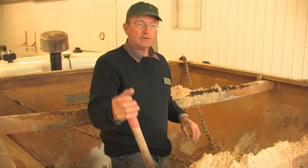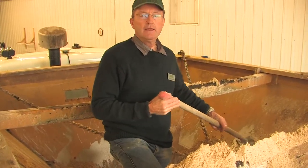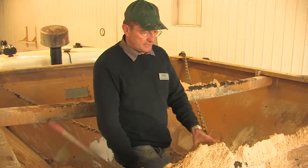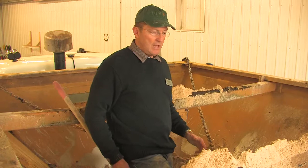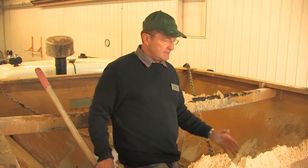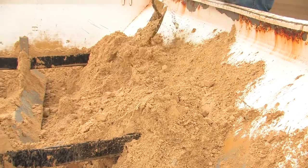Here we have a different setup — this is stainless steel but it's painted, and unfortunately gypsum sticks to paint, so it tends to hang up on the sides. In addition, there is a very large shield over the belt that is close enough to the belt that gypsum will actually bridge as a result. When spreading in rain, this combination of painted sides and the shield creates a bridging issue where we just don't get the flow of gypsum we need down onto the belt.